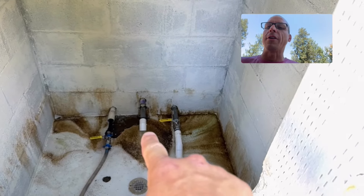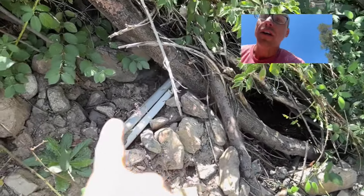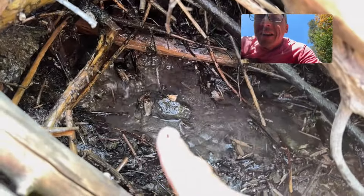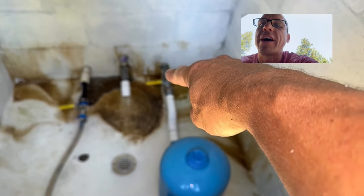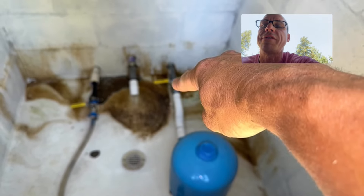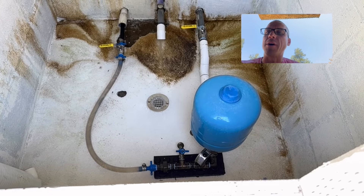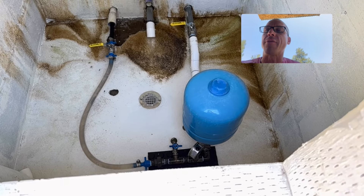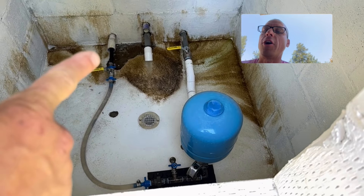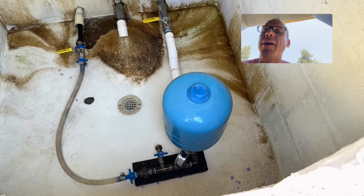That right there is the overflow line that comes out of the top of the ram pump buffer tank. All the water flowing through the system is now coming out this overflow line and flowing into this floor drain, which leads through these overflow lines that return the mountain spring water back to the mountain like we never touched it at all. This is the ram pump drive pipe — the steel drive pipe that comes out of the bottom of the buffer tank — and that's what feeds and powers the ram pump, that water rushing downhill. This line that exits the ram pump is called the delivery line, and that's what the ram pump uses to pump water up the mountain through 600 linear feet of water pipe buried four feet underground over 100 feet in elevation rise to the top of our property. To take the ram pump out of bypass mode, we open the ball valve on the delivery line and then the ball valve on the drive pipe, which begins the ram pump cycling indefinitely — moving water up the mountain with zero electricity or fuel.